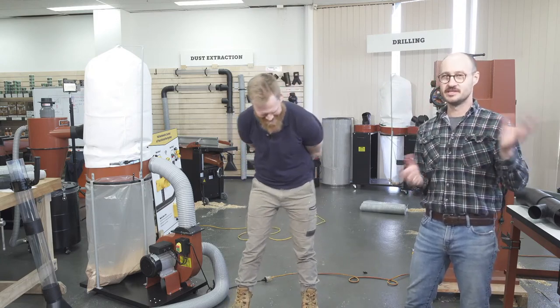It's not legal just to file down your 15 amp earth plug and stick on a 10 amp one. So don't do that. But these devices are pretty cost effective, though they won't work on a machine that's regularly drawing more than 10 amp. You'll pop the fuse. If you're putting a big bit of timber through our big machine and the motor starts working harder, it'll start pulling more current and the Amphibian won't help you there. It's only for the startup current draw.